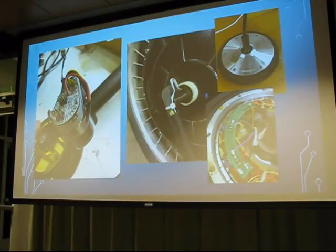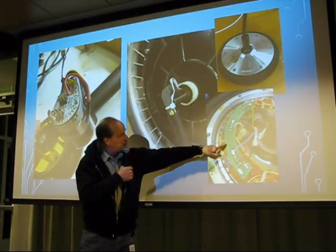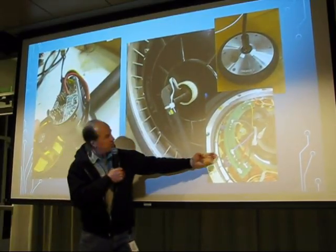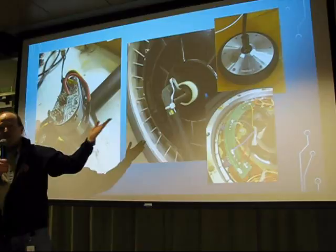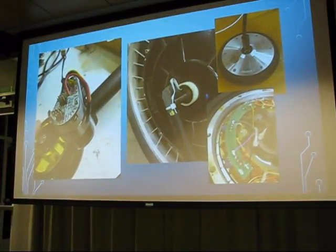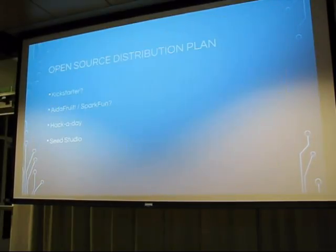And even though this has 3 separate Hall effect sensors, it turns out if you just take one Melexis device and glue it onto its board, it actually sees these magnets coming by. And since they're polarized opposite each other, the Melexis sees the sum of those, and so it looks like a rotating magnetic field. And so without even adding a magnet, we can measure the position of the wheel. And the biggest surprise was the fields from the coils do not interfere. I didn't expect that.